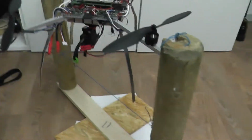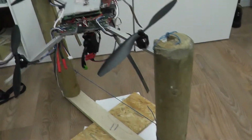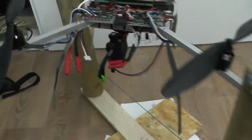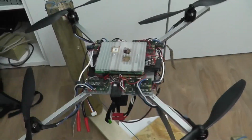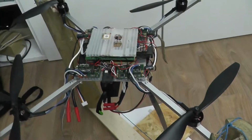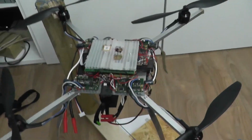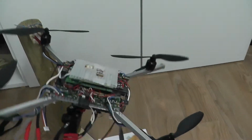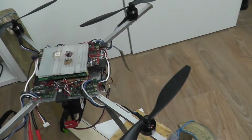After constructing it and having at least two motors running, I had to test the balancing feature, to test the PID algorithms, how the quadrocopter is able to keep the balance, how fast it can change the degree it has to stand. And I couldn't really test it, because if I would fly it directly after developing all of this, there would be a lot of crashes. And with this structure, I'm able to test the balancing feature without it having to fly. I think this is also something I could show in the next video.